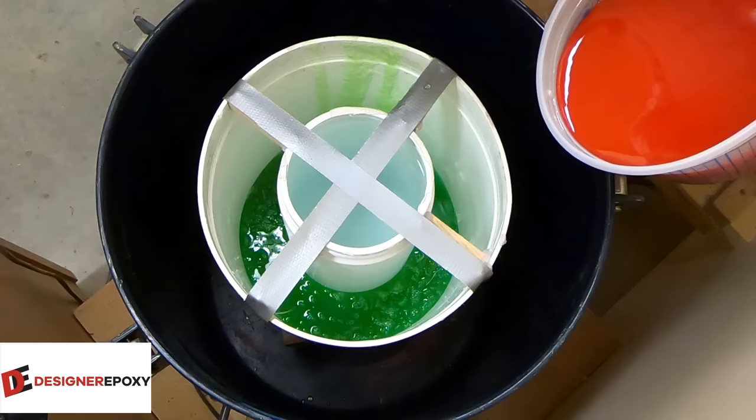All right, so we're going to have to change it up on this piece a little bit. I realize I'm wearing shorts, but it's actually too cool here in the workshop for these resin finishes to cure properly. This one was fine, and we did a good job covering up all the wood, but as far as trying to lay it out flat is concerned, it's just not going to work. It's not meant for this, but it certainly filled in all these little holes that we had. So that is great. And it also sealed up the wood.